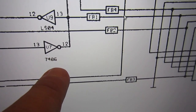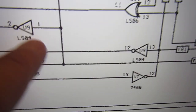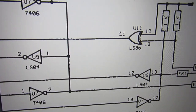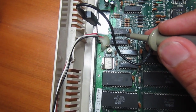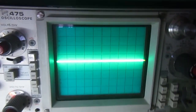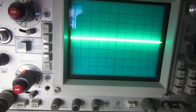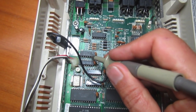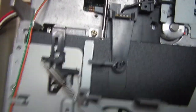Clock also goes to pin 12 of U7 which is the output, and data goes to several pins of U9 and U7. On the actual board, pin 13 of the LS86 with nothing connected should be high, but it's stuck to ground. I think this is the first problem.